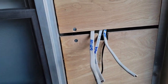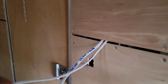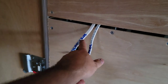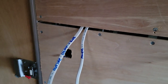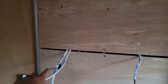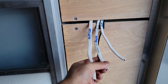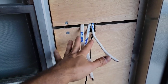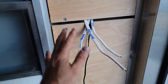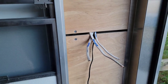That's gonna have two switch legs, being one for the outside light and one for the rope lights for the switch outlet. The other one's a power because we need a power that comes from the breaker panel. And that one we have to grab from over here as well, which we labeled right here, power. That's a 14-2 cable because it's just gonna have a colored wire and a neutral, being a hot. That's gonna be a home run. Don't forget, we're gonna cover what a home run is probably on the next video, but that's what it is. That's the recap of the electrical.